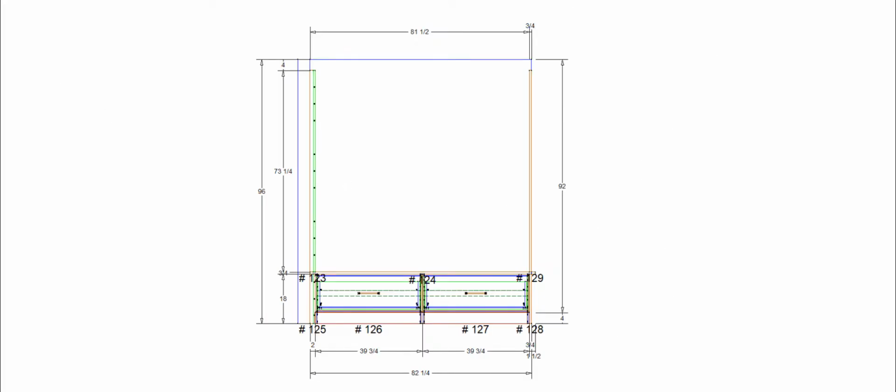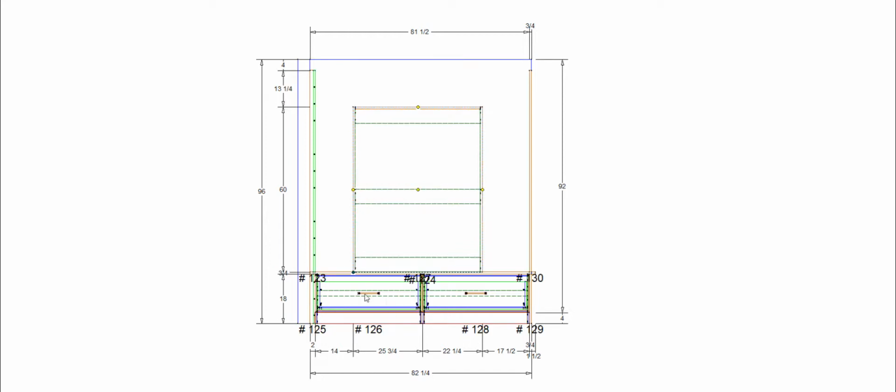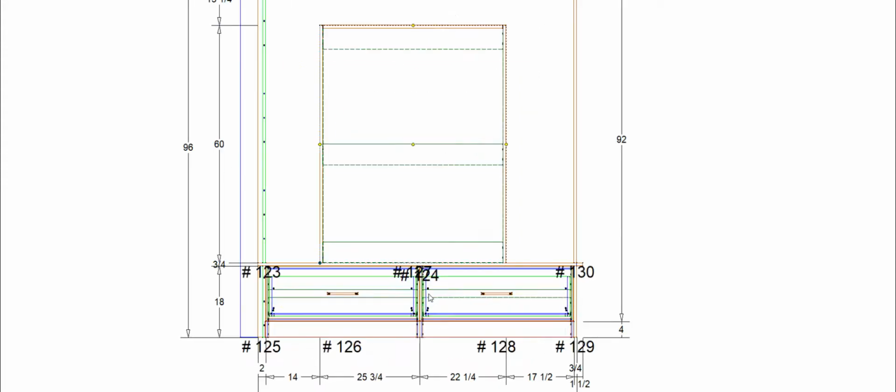Essentially what we're going to do here is go on to our newest one, which is the wall exposed alcove cabinet. We just added this one today. Oh, nice. Elevation there is going to be 18.75, because that's the 18-inch base cabinet plus this 0.75-inch tall finished top. And then I'm going to center it on these two cabinets.